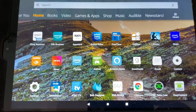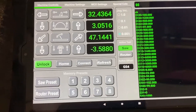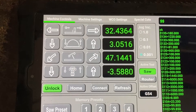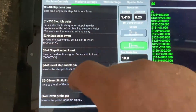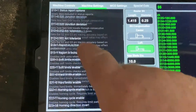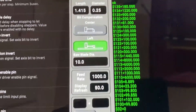This is the app I created for my CNC table saw. When you unlock it, it pulls in all the information from GRBL and gives you the readout of where everything is currently. Over here is the settings page where you can change all your GRBL settings — stepper motor control, direction, homing, and all that stuff.